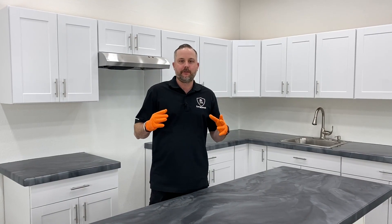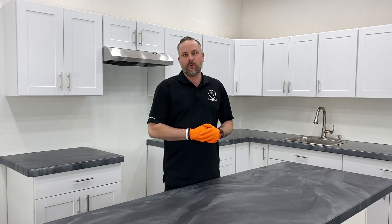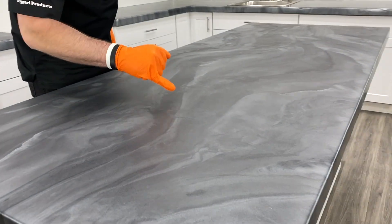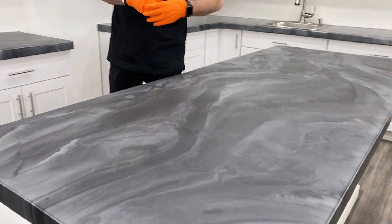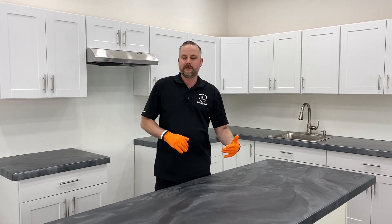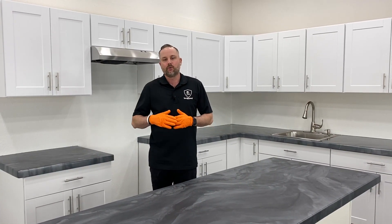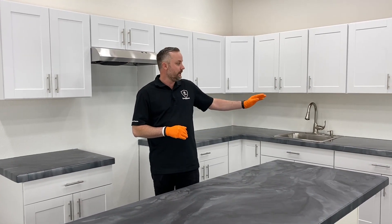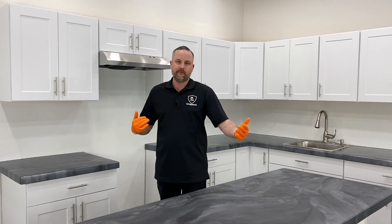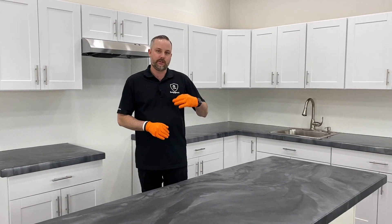When you're doing the matte urethane, you really need to do two coats over a glossy epoxy surface. If you sanded the top for imperfections, you could get away with one coat. But if you look closely, you can see some glossy specks throughout the top — that second coat will completely hide all of those. We coated this, pulled the tape off, and you can apply your second coat the same day. Once the whiteness goes away and it goes clear — usually about an hour to an hour and a half — you can apply that second coat. You don't have to wait 24 hours. That goes for the gloss as well: if you want two coats, you can do it within an hour to an hour and a half, once it goes clear. You don't want to go over it while it's still milky white.